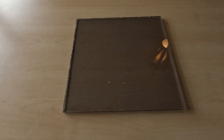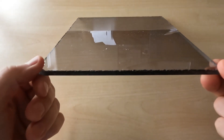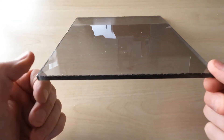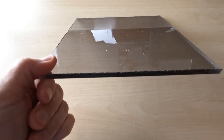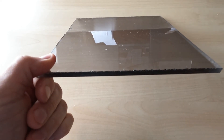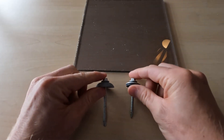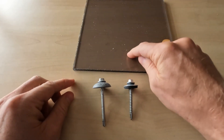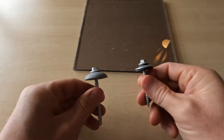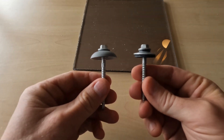The last product is solid acrylic or polycarbonate — generally around six millimeters thick. Usually you'll use joiner bars on this and try not to use fasteners. However, if you do need to fasten it down, there are a couple of options: you can use either the custom glaze fastener or the twin wall fastener. Again, you need to drill an expansion hole through first and then use something with a big enough washer that's going to cover that expansion hole.